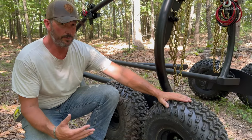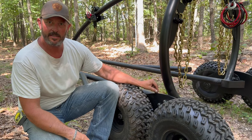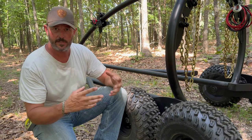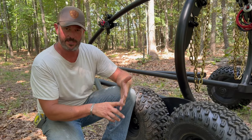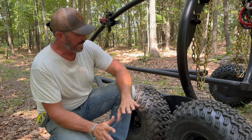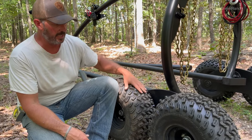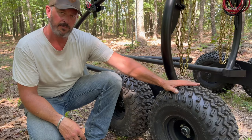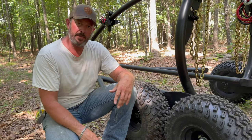What makes this machine more unique than pretty much anything on the market is this: it's not a new design and I'm not claiming it as my own conception — it's a very standard mechanical feature on many trailers and military vehicles throughout the world. Many of you would know what a walking beam suspension is, especially if you've been around a logging truck or a Hendrickson suspension. We've adapted that to a 3,500-pound stub shaft. These are 5/8 plate, all laser-cut, and these spindles — all greasable — are rated at 1,100 pounds. The tires are rated at 1,000 pounds, so we are giving this machine a 3,000-pound rating.